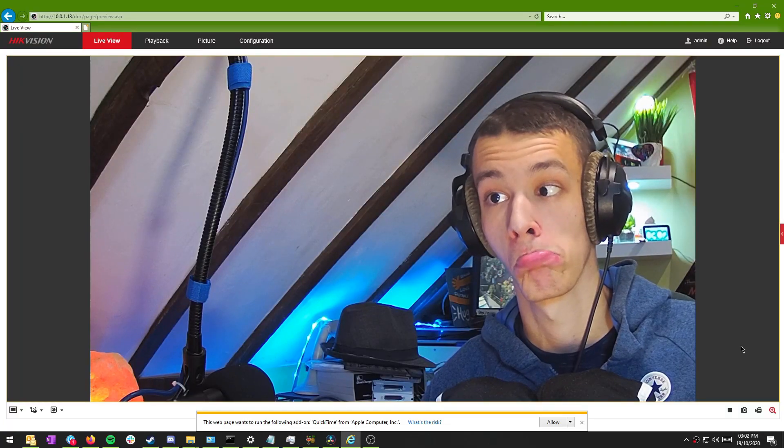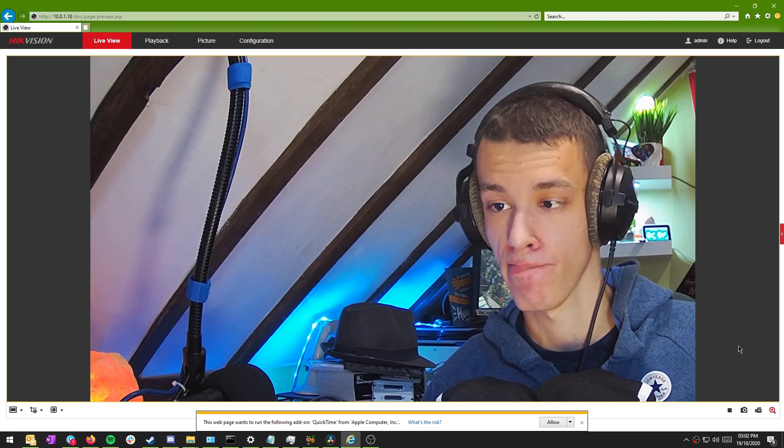As you can see on the end you've got your ethernet connector that can go into your router, and then a little power connector which you can plug a 12 volt adapter into, like you would use on LED strips. I ended up using a Hikvision one - it's already mounted so I can't show you. I've got the lower dome removed because I get a clearer image the way I've mounted it. The camera's plugged into my router and now these Hikvision cameras use a piece of software called SADP Tool.